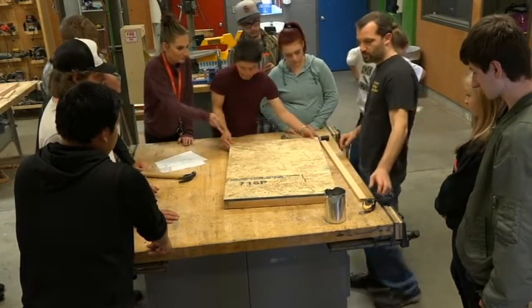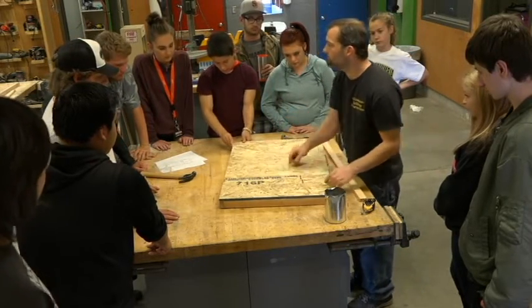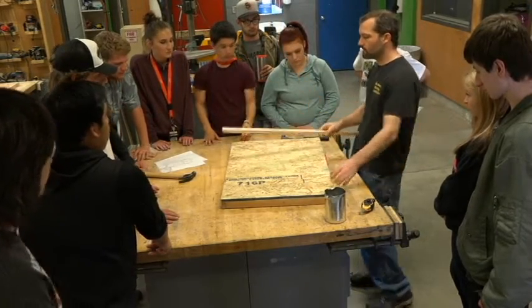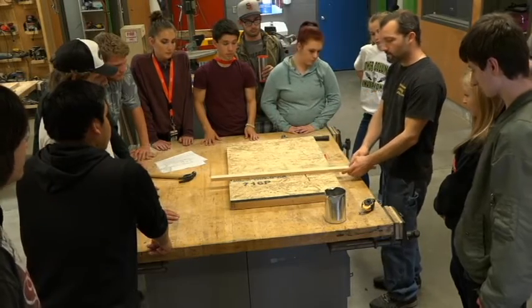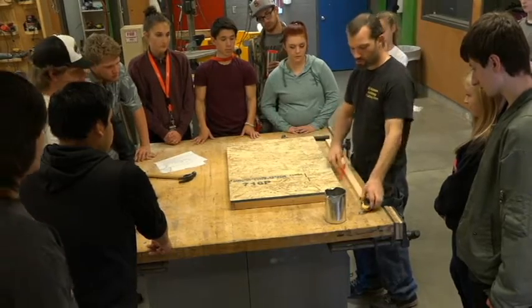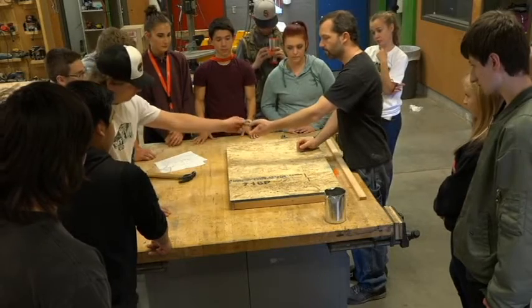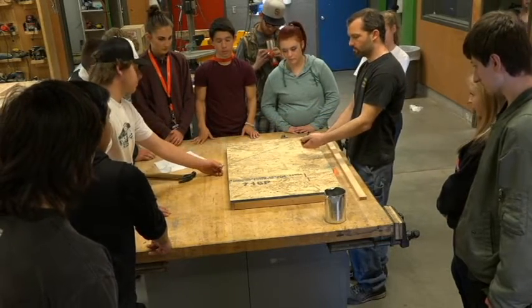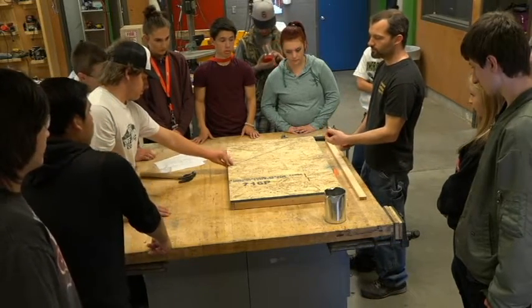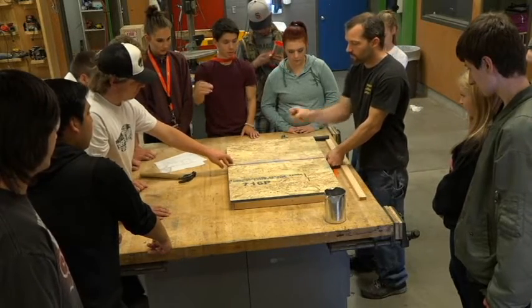After you've nailed off both sides, you need to nail where the joists are underneath. There are two ways to find them: if the chalk line is busy, you can take a regular stick, line it up with the nails underneath, and draw a line — now you know where to nail. Or if you want to get fancy, hook the chalk line, put it right above the nail, pinch the string, bring it down, and snap it.